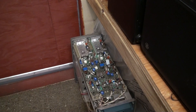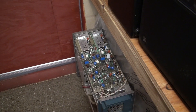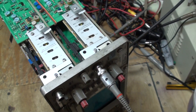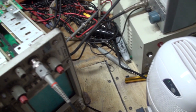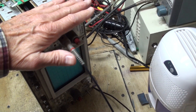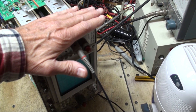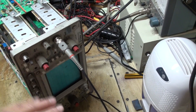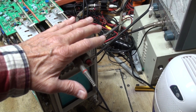I put the Tektronix 465B on the bench — the one that has the broken control. This is the 465B, the one that has the broken positioning control for channel A. This one works very well; this is the one that does not snap. Matter of fact, the other one, when I turned it over, the trace went out when I turned it on the side like this, and went back on when I put it back down, and each time it snapped.